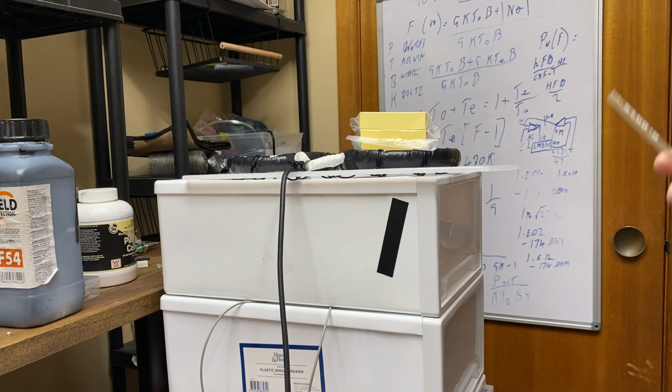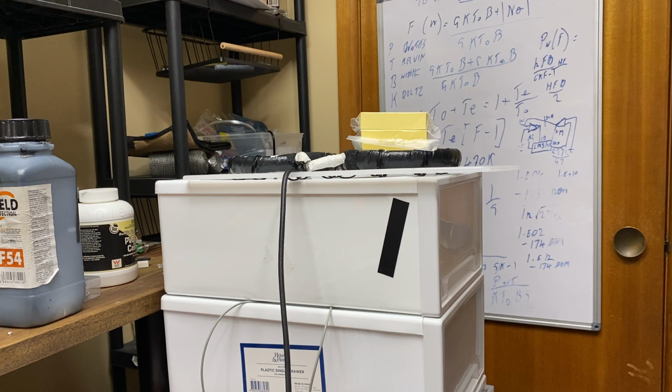Even to make it better on this one, I'll give this one a frequency. I'll give it a better than fighting chance. I'll give it a complete frequency reset. Let it scan for the quietest part of the spectrum. Okay, if I can find the button on it. Where are you? There. Okay, so I'll just let that do its bizzo and see if it can find a bit of the spectrum that's dead quiet for it. These are just noisy detectors in general. They just are noisier than the higher gain 4500.